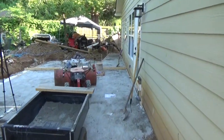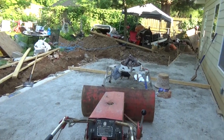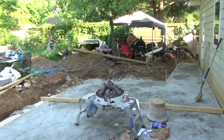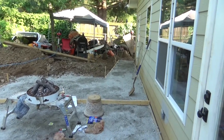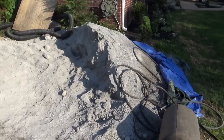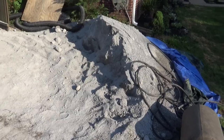The patio is starting to shape up quite a bit. Got most of the gravel spread. I'm just doing my final screed over the gravel. Tomorrow I'm going to bring in a compactor and compact the crap out of it and then go get some sand. We should be ready to be putting down some stones. Yeah, the pile's getting smaller - I'd say it's less than half right now, which is good.